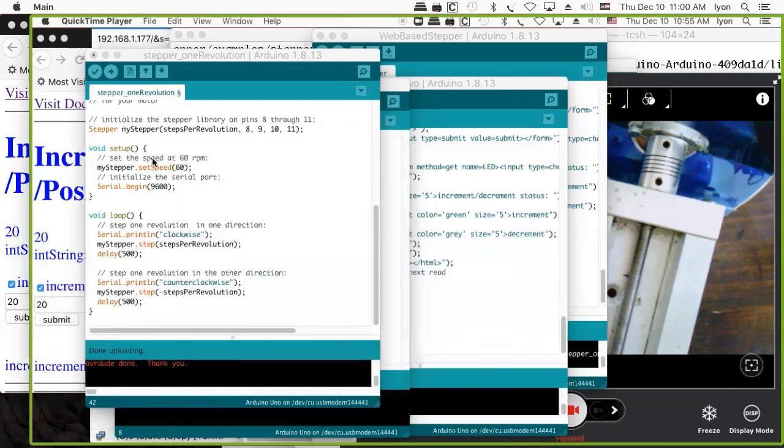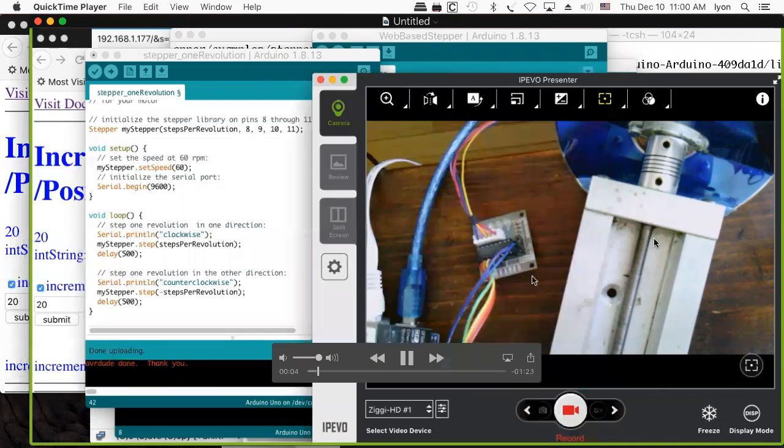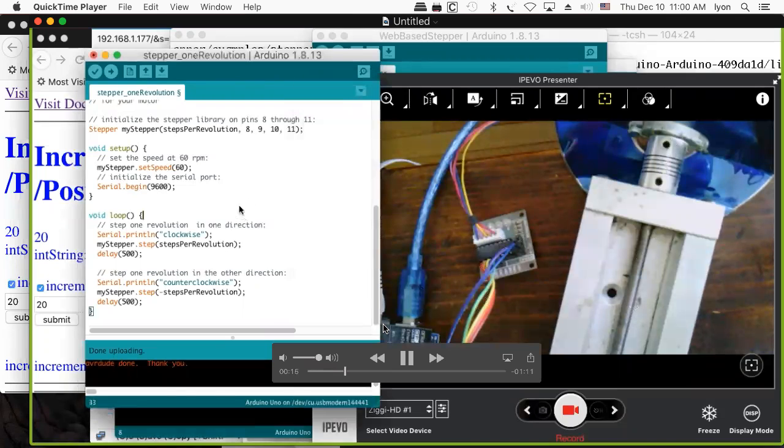I was just mucking about with a little demo that I was playing around with, and I thought you might like to see it. This here is a screw that's hooked up to a stepper motor, and I'm using a ULN2003 Darlington transistor array hooked up to an Arduino with a little Ethernet shield. When you run the stepper motor, you can get a lot of precision over the motor control and the linear motion that's created. Here you can see small turns in the stepper motor will give you very precise linear motion.